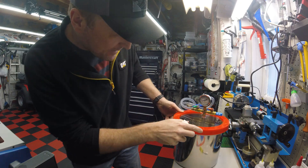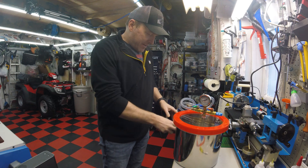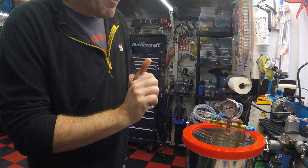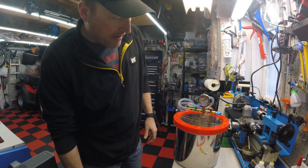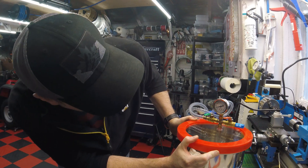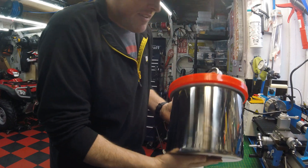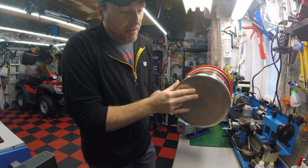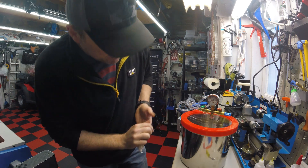That's pretty darn respectable. It drew that down in a rush - holy smokes. There's a little bit of a gurgle coming from the pump and quite a bit of vapors coming out. I'm guessing that's probably oil from the thing being kicked around in shipping. There we are on our pressure vessel holding - it didn't implode. We're at about 27 and a half inches of mercury thereabouts. That's pretty impressive. I think we could darn near boil water at ambient temperature in there. The bottom's holding - it's not imploding. It is noticeably bowed up, there is definitely a lift on the bottom, maybe two millimeters or a little bit more since it drew down. It's holding just fine.